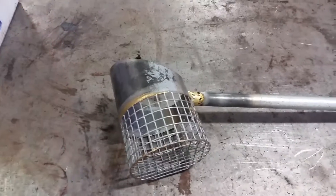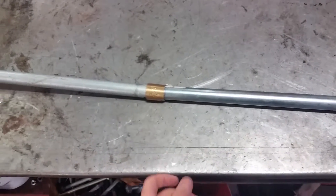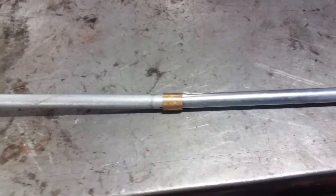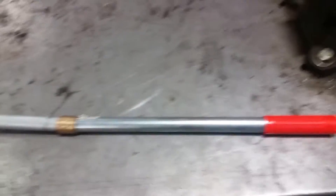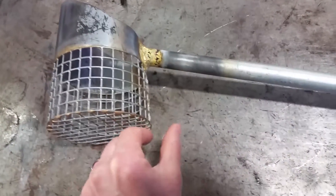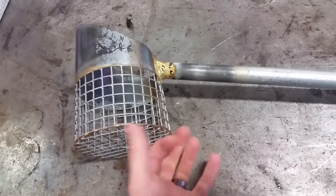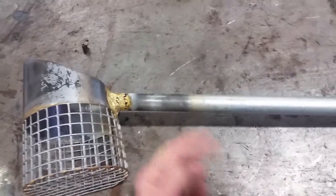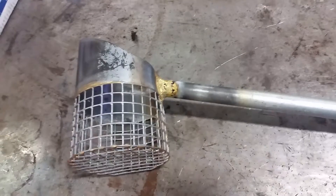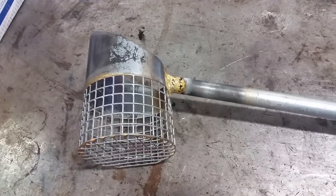I picked it up last Tuesday. What's going on with it is the handle was busted right about here, so there's a piece of brass on there that he had put some screws in to hold the thing together. I'm going to reconfigure the handle system, take some steel and weld it on here, coming up and across down the other side to give it a brace so when I step on it to push it in it doesn't crush this basket. I'll also run a brace up to give it strength there. Someone has done some brazing on it, so I'll make a start on this project and show you the process.